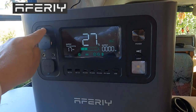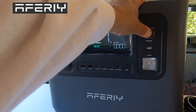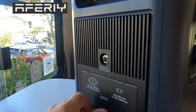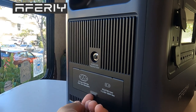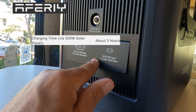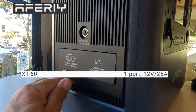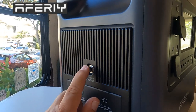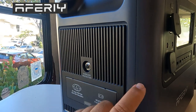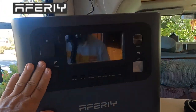You've got your cooling fan right here. Six AC outlets — press the AC button and it came on, pretty cool. We got the lights there. One-thousand, two-thousand, three-thousand and she's out. Then we have the inputs right here: your AC, 50 Hz to 60 Hz switchable, 100 to 120 volt. And then your XT90 for the solar panels — 500 watts max, 11.5 to 50 volts input. Overload protection is pretty cool — if anything overloads while plugged in, the AC shuts off. Make sure everything's unplugged, turn it back on, press the overload protection button and it comes back alive.